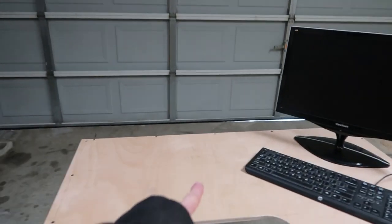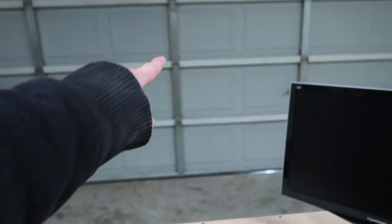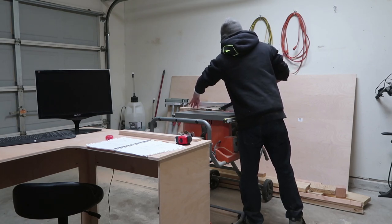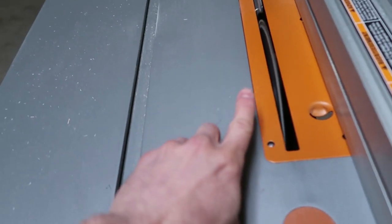I'm going to be building a cabinet on the left side since there's going to be a window on my right side. So I'm going to do 18 wide, 10 deep, and then I think 18 inches tall. I'm going to go off to the side of my walls because my guitars are also going to be going on the walls as well. And then I brought my monitor out here to figure out exactly if this is going to be too big or too small — seems it's going to be good. I'm just not comfortable on a table saw. I've used it many times, but I don't know if I'll ever be comfortable on it. This is going to get too close to that blade when I'm over here.